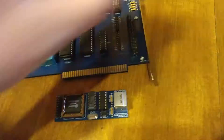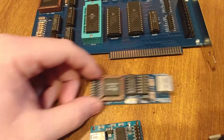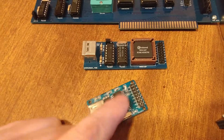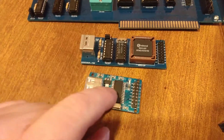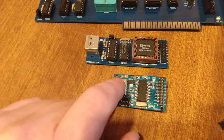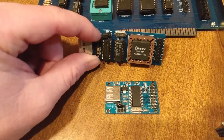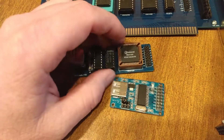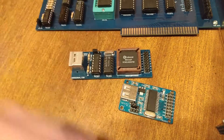I wanted to use a USB device for the keyboard, but I went ahead and made this keyboard controller instead because the human interface code for USB would require external firmware I'm not familiar with. This was a lot easier to build. So if somebody wants to figure out the USB keyboard approach, that'd be great. I used the Winbond 83C42. This is a hardware keyboard controller — it was designed, I think in the nineties, to replace the 8042.